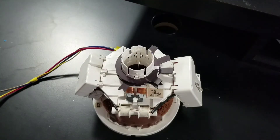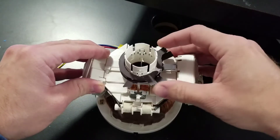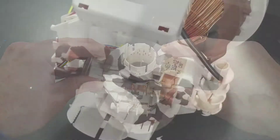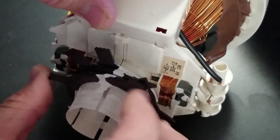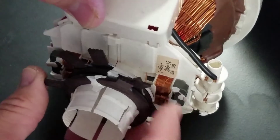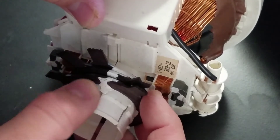Let's talk about what adjustments you can make on your yoke. Just remember to avoid any of this copper wiring while it's installed. The first thing you'll notice are your rings up here. A lot of times these are epoxied together originally, either in the manufacturing facility or in the field if it was set up for a specific purpose. These are referred to as our convergence rings. Normally, without the buildup of old epoxy, you would be able to freely turn a couple of these, and they control individual color beams on your screen — that's how you line them up so you get solid colors without a separation of red, green, and blue.